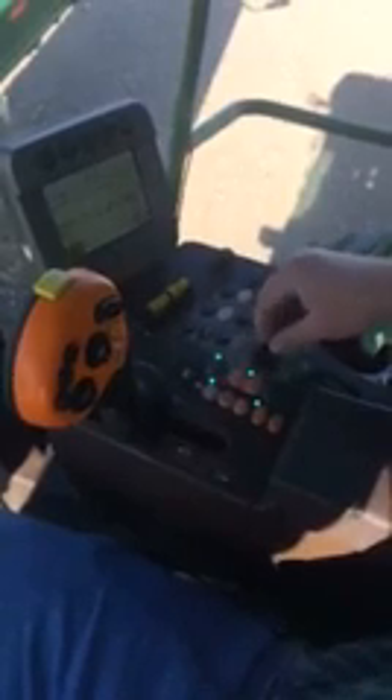Make sure your parking brake's on. We're going to go to high idle. We've got to decrease our cutter bar pressure — that's the triangle with the wavy line down here. We need to press that. It's going to show up on top, but that's okay because we'll just dial it down.